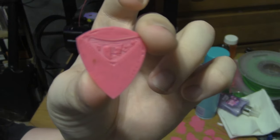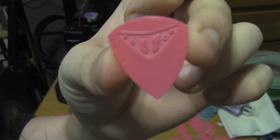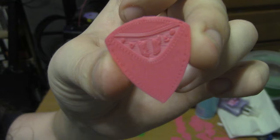Moving back to the tests — I did another test batch, still with hairspray and a change to Polymax PLA+. Starting with the outermost printed pick: it's atrocious. The next one in turned out much better but was still not nearly acceptable — it had a brown spot on it and I don't even know how that happened. The next had rough lines with porous gaps. Finally, the center was much like the last but with finer gaps.